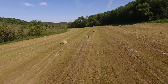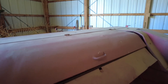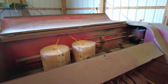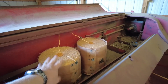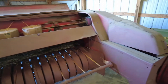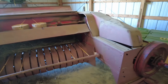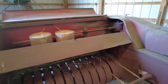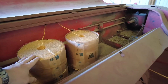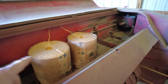Let's start with some lessons learned on square baling. I had a video on refurbishing this whole square baler. One thing I did not do — which I should have — I was using old twine that was in the twine bucket. I kept having so many issues with the twine breaking, and I couldn't figure out if it was a knotter issue. It turned out the twine was disintegrating as I was pulling it through. So lesson number one: always use new twine, especially the sisal biodegradable stuff — it will degrade over time.